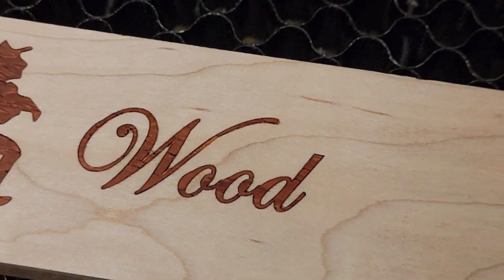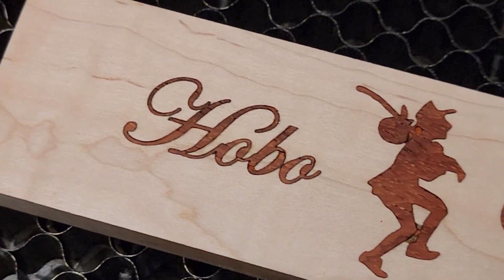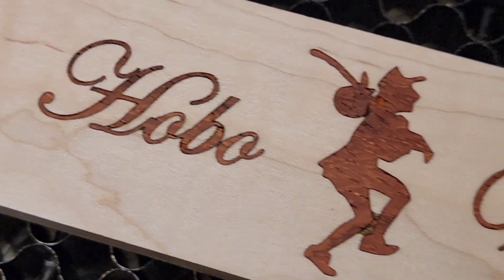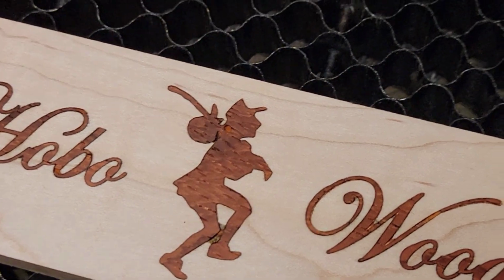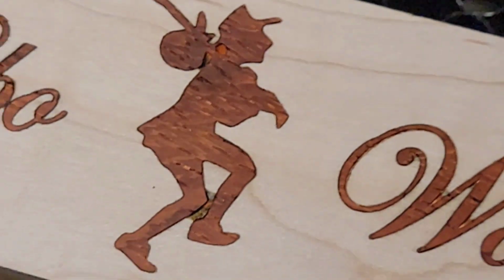But she was standing about a 0.5 millimeter proud or so, and just taking some 320 sandpaper, I sanded that down, got her good and smooth. Then I'm going back over with a finish plane to really get that knocked out and smoothed out. There's a little bit of blowout, but not a bad result for a first attempt at a real inlay.